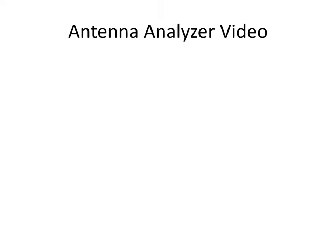Looking at the data we just collected, you can see the SWR coming down and then starting back up — the resonant frequency is in there somewhere. At the target of 7.238 MHz the SWR is 1.15, which confirms what we saw on the sweep graph: the actual resonant frequency of the antenna is a little bit below the target. We'll take this data and use it to figure out how we need to adjust the antenna to bring the resonant frequency closer to the target.